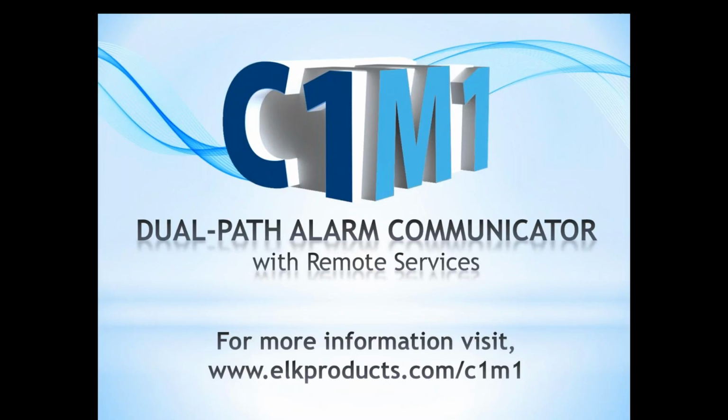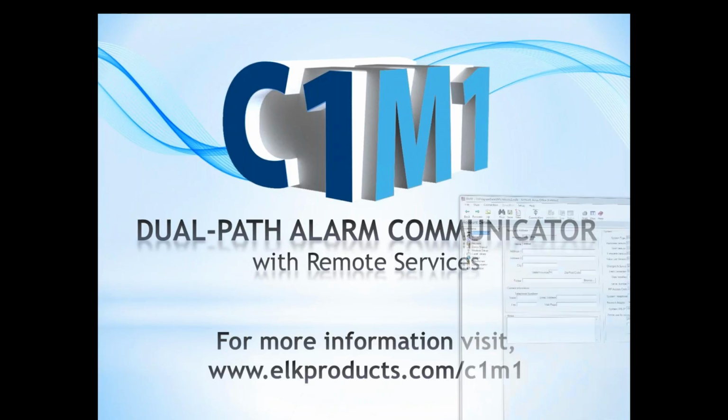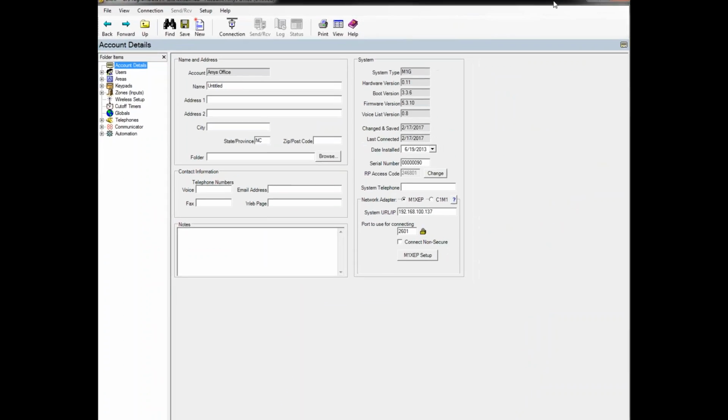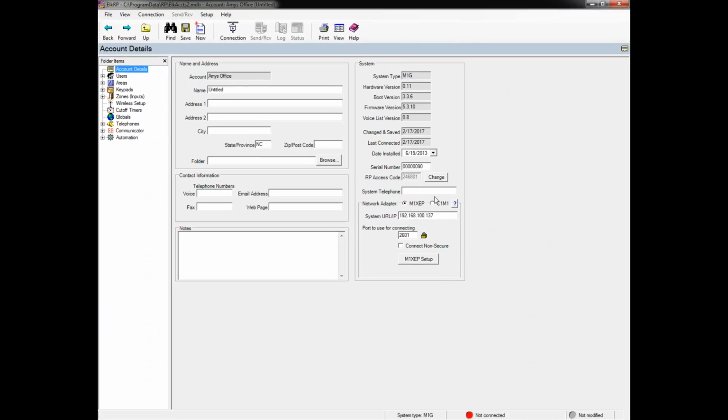Yeah, okay, so where in ElkRP do you enter the passcode? Bear with me just a second here, and I'll see if I can get that pulled up for you. Okay, so in the ElkRP software, if you have C1M1 selected under Network Adapter, then you can check this option here to use secure port, and there's where you're going to put the passphrase.